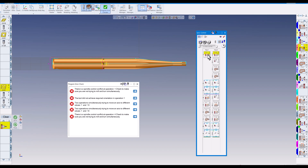I'm going to click on the top of this operation — you can click either the bottom or top depending on where you want the sync — and click the 'Sync' button. The sync puts the M-code in there. Normally on a Fanuc-type machine it starts at M100 and goes up quite a ways depending on the machine. So the lower turret faces off, then we pinch turn. Next, I don't want the lower turret to start milling while we're still turning, so I need to sync those up as well.